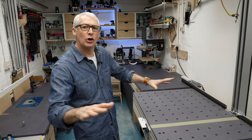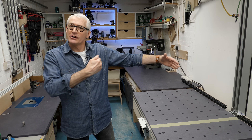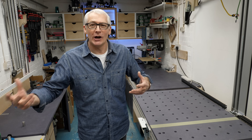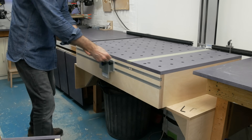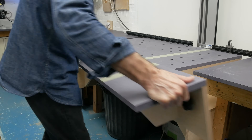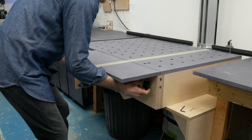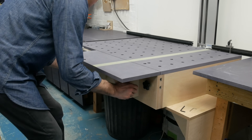So far we've got a pretty comprehensive bench setup — solid fence, a fantastic hinge, and a generous 800mm crosscut. But occasionally you'll need to crosscut 850 or 900mm or more. In that case I remove the front rail support and fit the table extension: a simple shelf made from birch ply and Fibro Colour, just like the bench, which attaches to the lower T-track and extends the crosscut to over a metre.